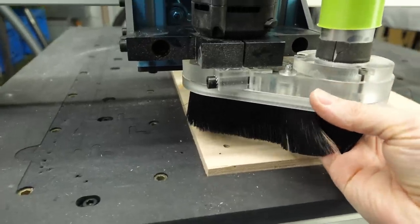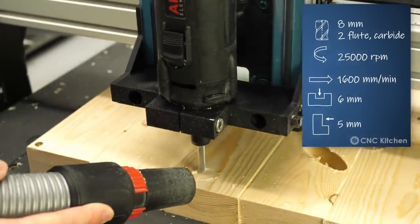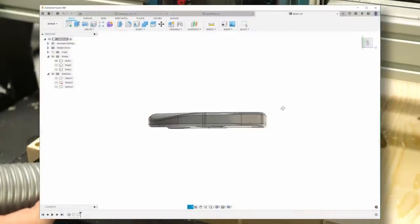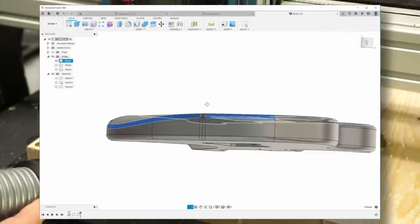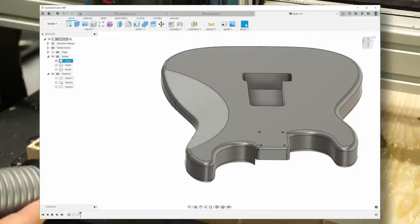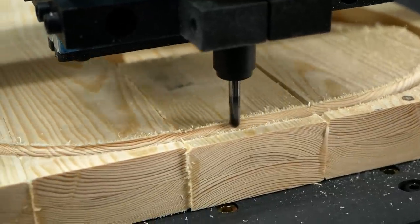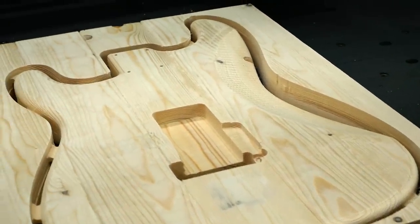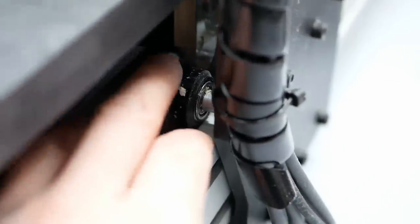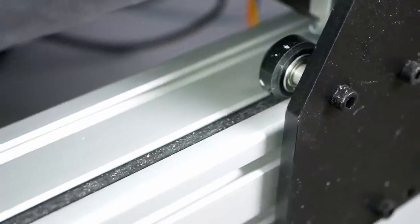Next, I machined what I think is my most complex project to date. A friend of mine wanted me to machine an electric guitar body for years but my old machines just weren't big enough. The body is more complex than it looks because it has angled sections and, most challenging, a 3D chamfer that goes all around the part. Making it even more complex, the body had to be machined from both sides, which of course had to be aligned to match up. The whole job had 23 operations in the Fusion 360 CAM setup using four different tools and took over two hours to machine. Even though this was only the pinewood test piece, the result looked stunning and I only had one slight mishap where the zero position somehow got lost. During cleaning I spotted another problem with the open belt setup — all the dust and chips that fly around can potentially land on the belts or rollers and might cause problems in the long run.